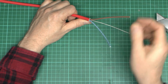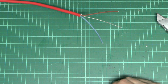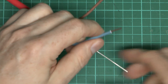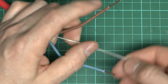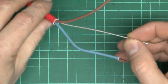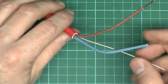Inside we've got the two insulated conductors — blue and brown — and then the bare conductor for the CPC or circuit protective conductor. Now I've just stripped the ends of the wire there. We can see that inside it's just solid copper, pretty much nothing unusual there. The single bare one here is actually a silver colour — it is copper, just tin plated. That can reduce corrosion on the outside, because this conductor does not have any insulation. The inner core is solid copper with coloured insulation over the outside — blue and brown in this particular case.